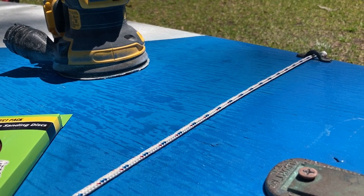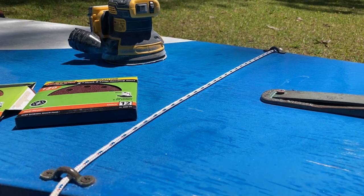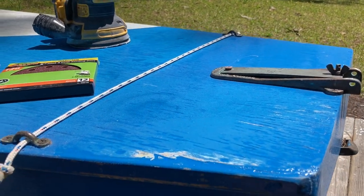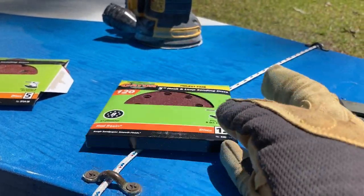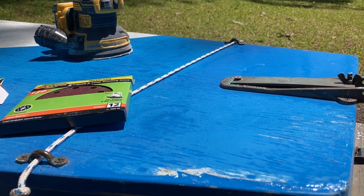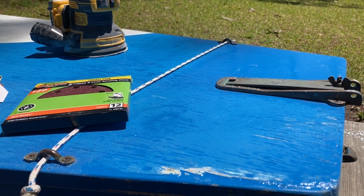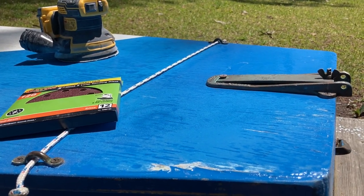And it's the same type of sanding we would do between coats of primer or paint, and we would not use 80 grit though. We'd probably use 120 or maybe 220. So that's a term Captain Jack taught us. We give it some tooth for the next coat. So that way across the whole surface, you've got something for the next coating to apply to.